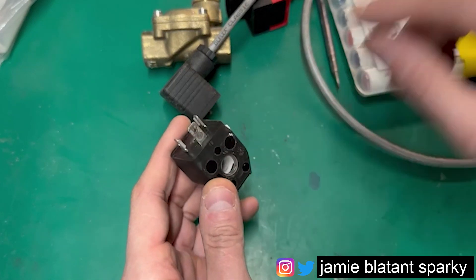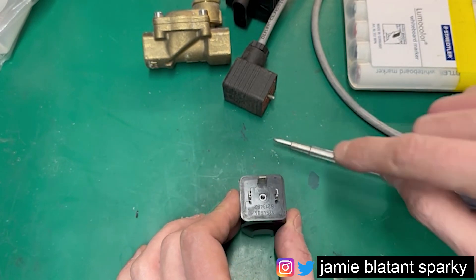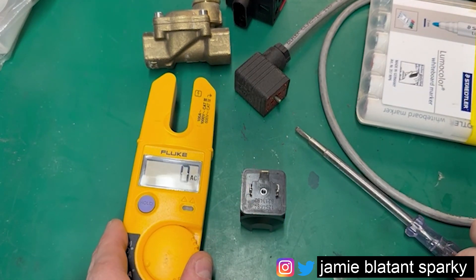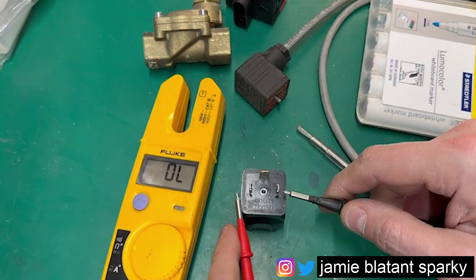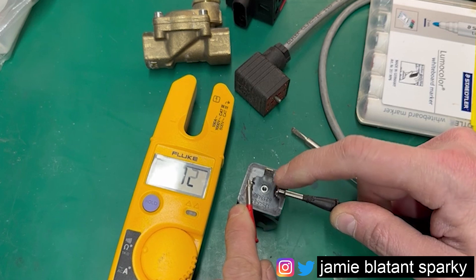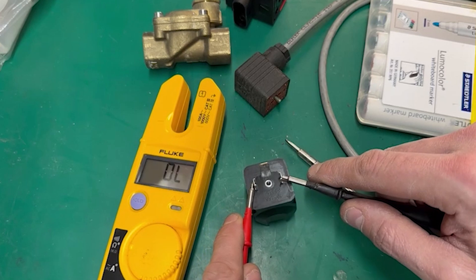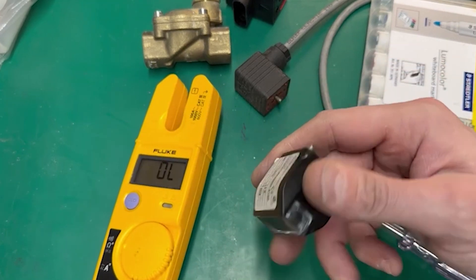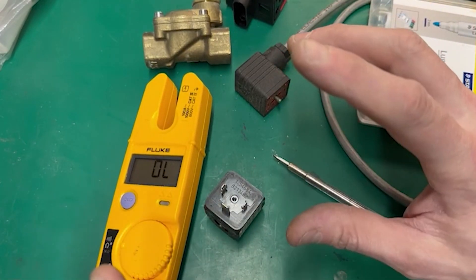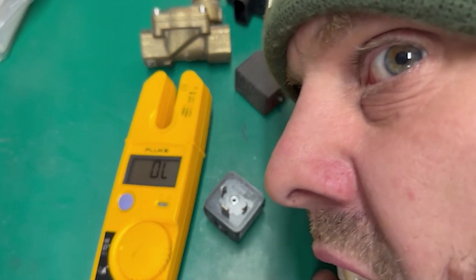To test solenoids: first I showed you the screwdriver method - energize it and you'll see it moving around. If that doesn't work and you suspect a fault, all you've got to do is get your tester, turn it on to ohms. That's got 72 ohms in it - that's normally a healthy reading. If it's burnt out it'll read really really low. That's it - I'm not going to give you all the numbers; get it out, play with it and test it yourself. If you want to know anything else about solenoids or think I've not covered anything, let me know in the comments. Thanks for watching.